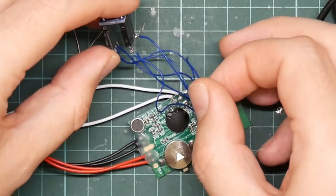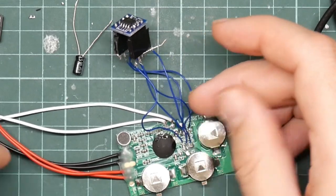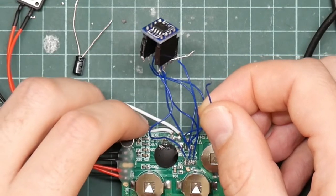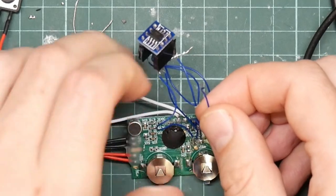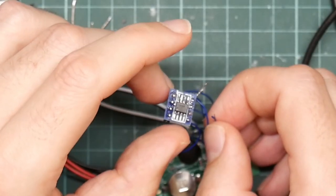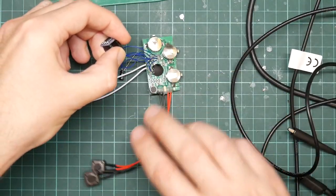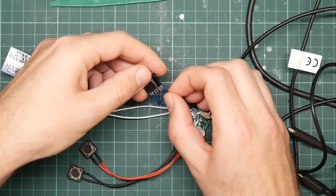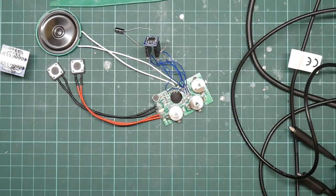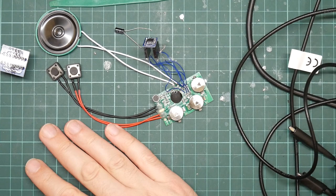Hello, what's this? Was this wire important? Hey, look. Apparently it wasn't. It's the power supply for the chip. Oops. That should go on here. Was this what was causing the problem? Hey, look. Apparently we don't need the decoupling capacitor. No, apparently that was it. It was just a capacitor that wasn't wanted. And it's getting enough parasitic power through its data lines to work fine. Well, I thought that was entertainingly random.